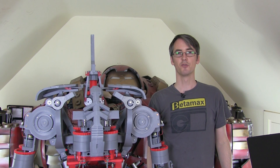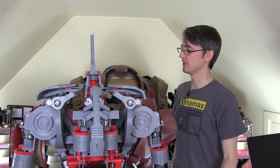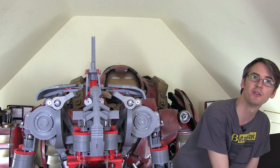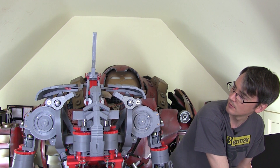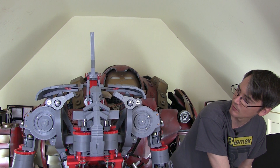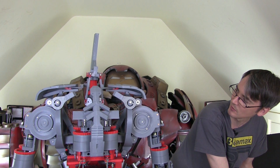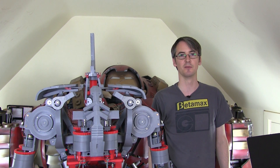Turning my knob, the head now turns in that axis. I've run in five volts from the power supply - the electronics are still running on a different five volt USB power bank - but I've now coded in the servos to work with that Arduino Mini as well. Turning the knobs, I've got one that rotates the head, one for back-to-front motion, and one for side-to-side motion. They all work at once. I probably need to make those sticks shorter because I get the most side-to-side movement when the head is up, but the electronics is working.